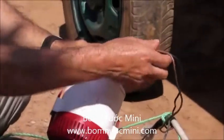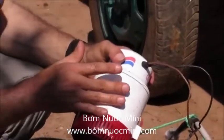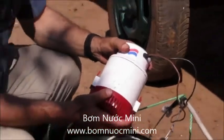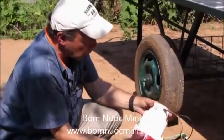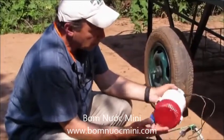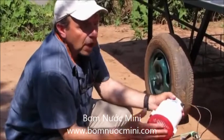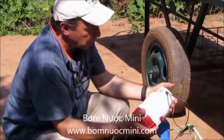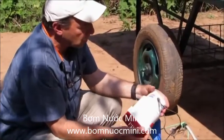Inside there's simply a sealed DC motor with the impeller attached. There are two leads coming out and there are no electronics — it's a brush motor, which means that the lifetime is limited. Somewhere in the literature it talks about the number of hours of use you can expect from this pump — it would basically correspond to about one year of daily use during daylight hours. And if this pump can give us one year of continuous use, we'll be satisfied.